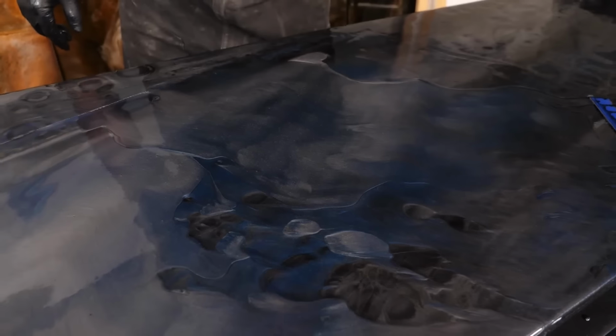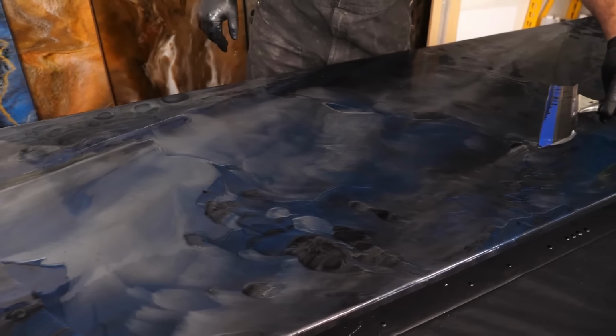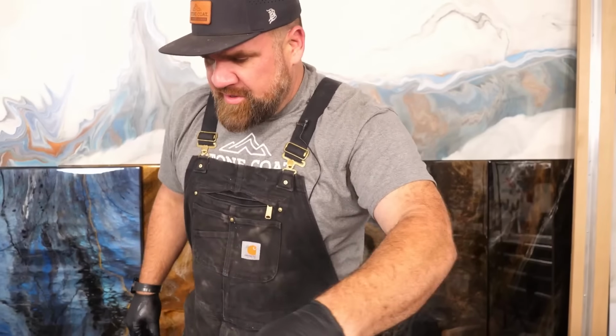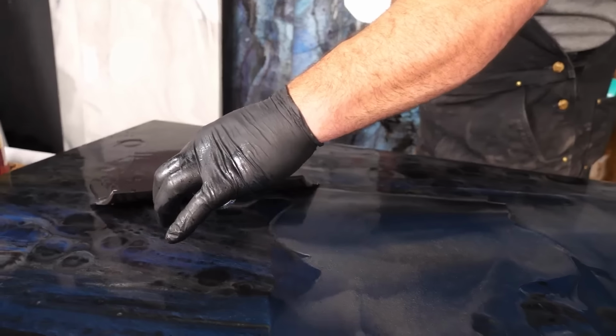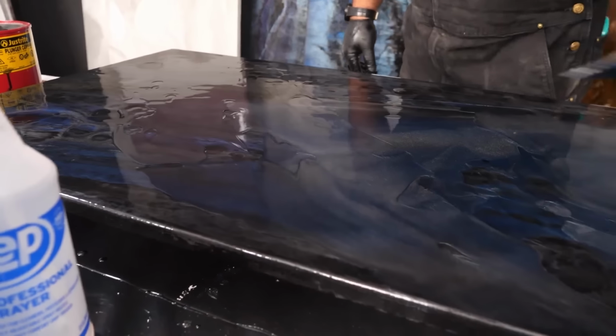And I think what I'll do is magic trowel this whole piece. And I'm barely, guys, I'm touching the trowel with my fingertips. The edge of it's here in my hand, and I'm using very, very subtle pressure. You can see how it kind of skips around. I'm just barely moving it.